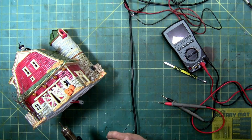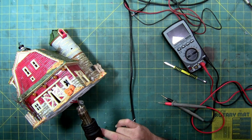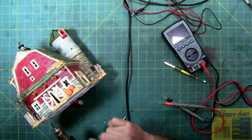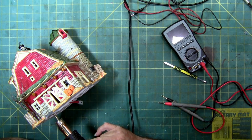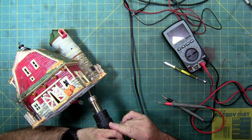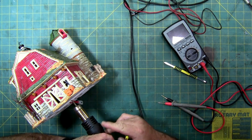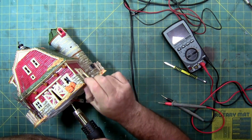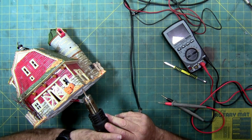So she's almost there. So the top started moving, but there's a section right in here that doesn't budge at all. The cracking you heard was just the glue. I don't like how they have this off to the side, so when you put pressure with your spudger, you have thin spots. So you gotta be really careful on prying. So you gotta feel it.